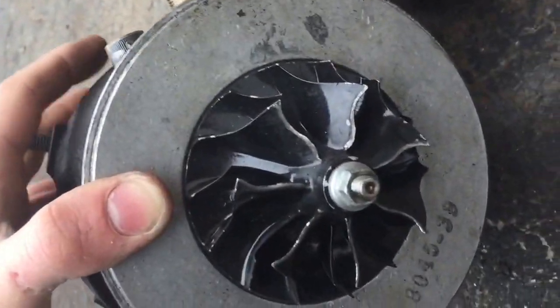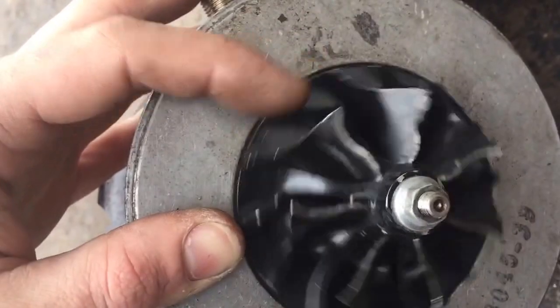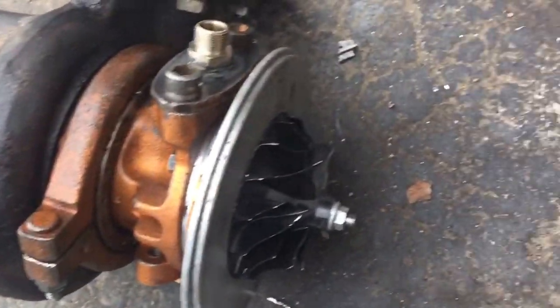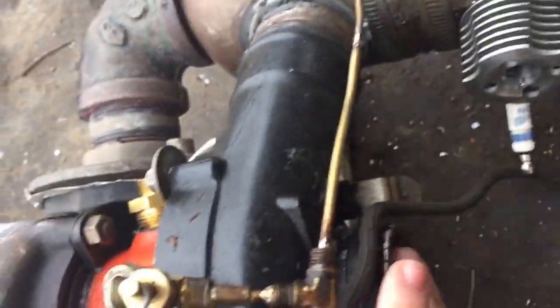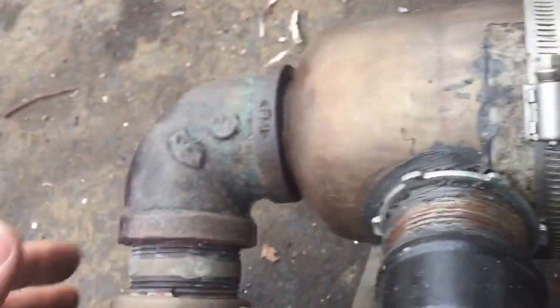I think it's used on like a Toyota Highlander. You can see that the impeller — I modified it; I ground that away myself. It seems to run pretty smooth and it's a lot quieter. So basically it's going to pull air in through the big turbocharger, then compress it a bit, then force it into the smaller turbocharger, compress it even more, put it into the combustion chamber, burn it, then force it out.